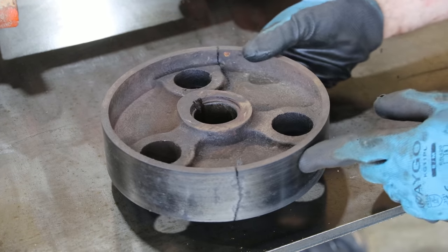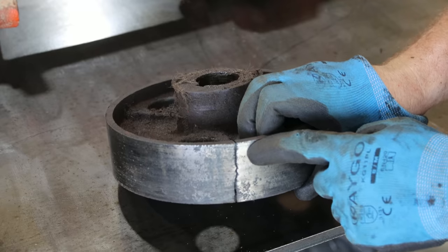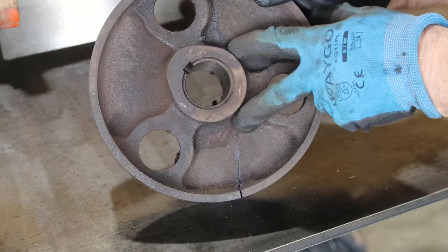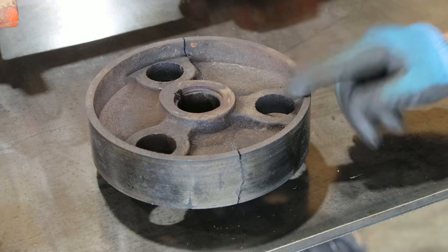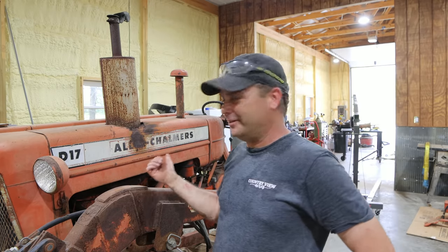This is the brake drum that is cracked. You can see the crack there, and then as we look at this side, the crack goes up, and there's a crack that forms again on this side. It's not quite cracked all the way through — it stops right in the middle where the hub is. That's a brake drum I plan on definitely replacing. I won't make you guys suffer through me tearing down that other axle — I'm confident I'll be able to get that one apart. That's the update on the Allis Chalmers. I was really impressed with that hydraulic puller — I thought for sure we'd probably break the drum or I'd have to get the torch out, and it did it.